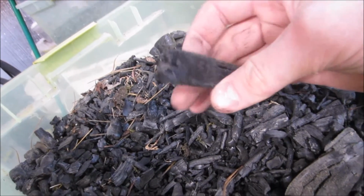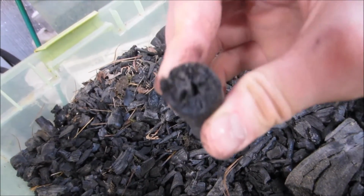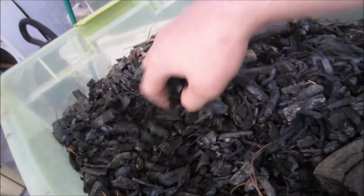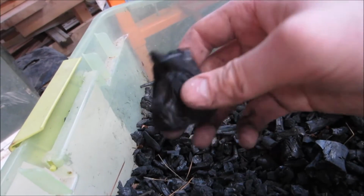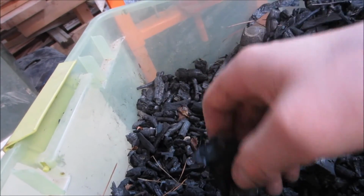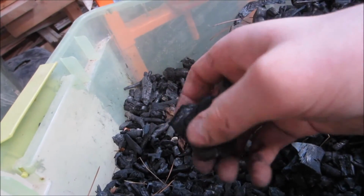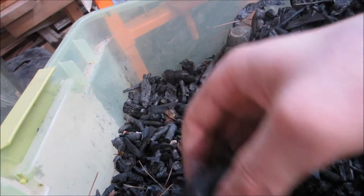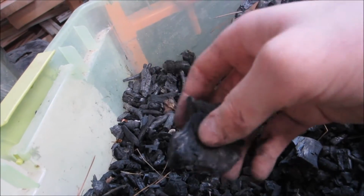Essentially what happens is the hydrocarbon gases are released from the polymers of the wood. And what you're left with are complex carbon structures, complex nanostructures with high surface area. This is not to the extent of activated charcoal, which has even more surface area, but it's still useful for my purposes. My objective is to use it as something that will absorb heat energy, or in this case, probably microwave energy, is what I'll end up using it for. But it also makes a pretty good resistor because it is so impure. So we want something that's not quite right, electrically speaking, a poor conductor.